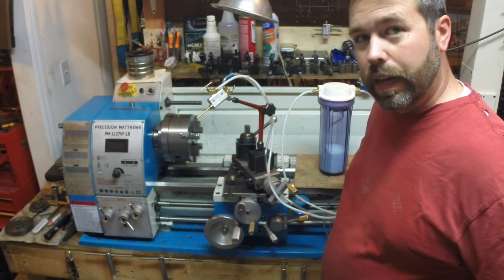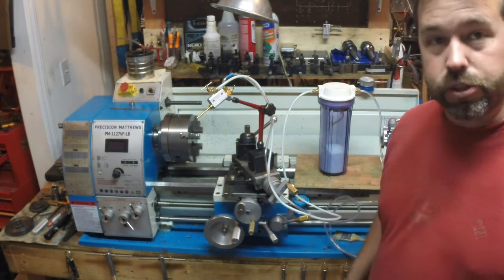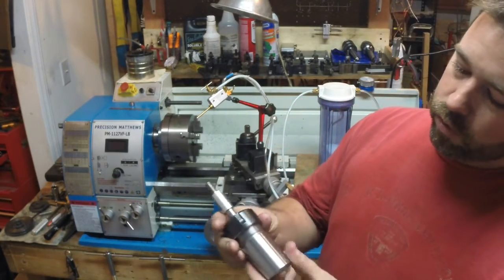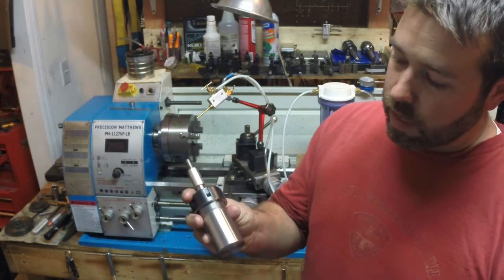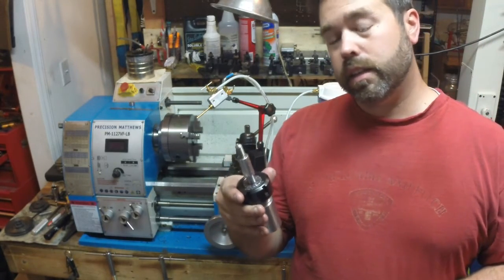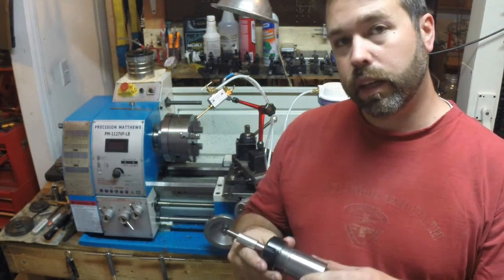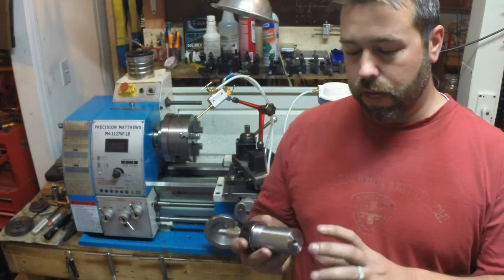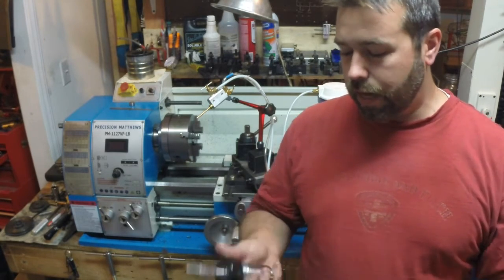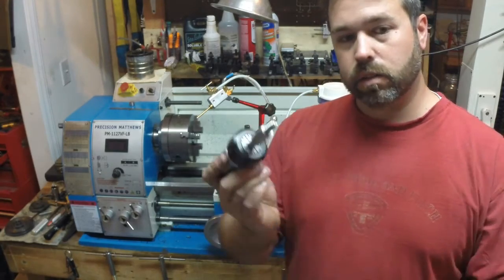One of the other things I've been up to lately is making an ER32 collet chuck. I just finished it earlier today. In the three-jaw chuck the best I can get is about three to four thousandths runout, so I'm going to try it in the four-jaw and see if I can dial it in. I'm also considering making an ER32 hex block and an ER32 square block instead of buying them — they're only about $35 a piece, but if I can make it I'd like to, and you get that satisfaction out of it.